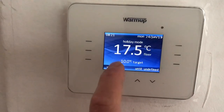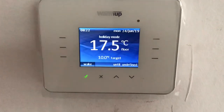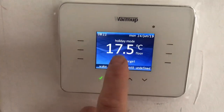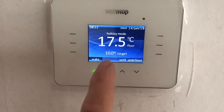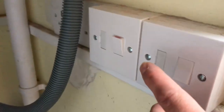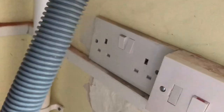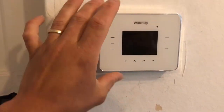When I came last time, this had a fault code on it, so I had a quick look online. I think it might be to do with the probe that gets inserted down the wall — it's either come disconnected in here or it's faulty. There is a setting I've found in the manufacturer's settings where we can set this to read air temperature rather than floor, and then maybe we can get this to warm up. She's shown me this — the chap has added in a couple of points off this local ring: one being bathroom towel rail and one being bathroom floor heating. If we turn that off, that's now killed this control thermostat slash control panel.